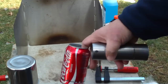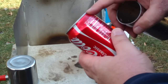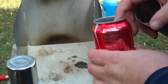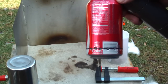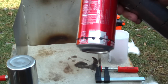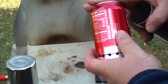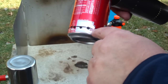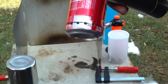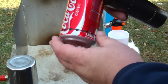You have this piece, plus you supply an empty 12-ounce can. The instructions show you how to take off the top edge and punch holes in the bottom. What I did was cut the top off with a side cutter, then I filled the can up with perlite - that little white stone stuff. Packed it in, put the lid back on, and held it with my fingers while I poked the holes along a line about five-eighths of an inch out. By filling the can with perlite, it keeps the can from collapsing when you try to punch the holes in it. Worked out a whole lot better.